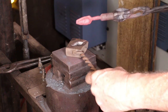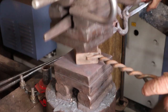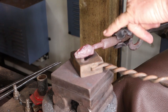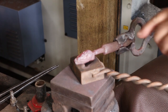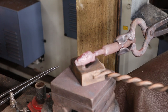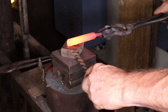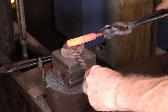There's the Clay Spencer made mouse die. You just sink the mouse in there. This one's already pretty much done so I'm not doing much, and the little flash around the edge will need to be ground down. But then the tail will draw out into a hook and I'll probably cut it off right there. But let's make one from scratch just because we can. This just goes in the die and you just accept that there's going to be some flash over the top.